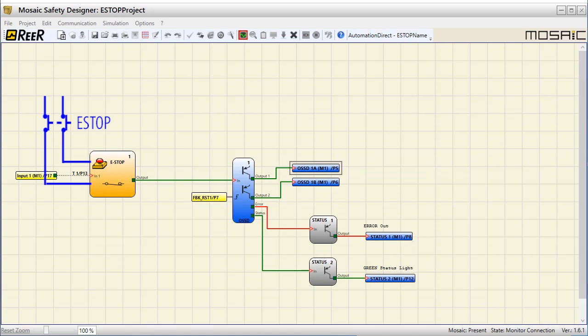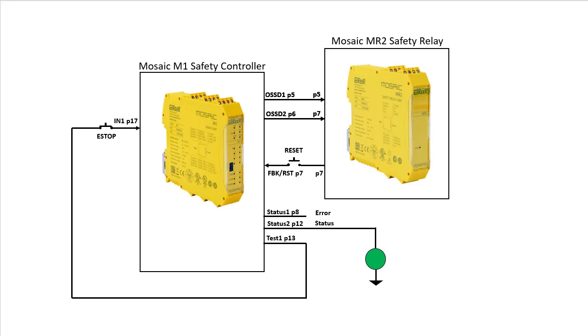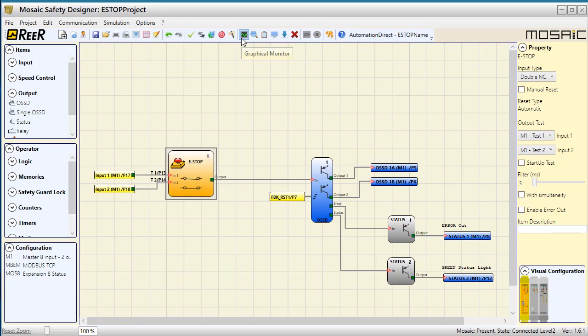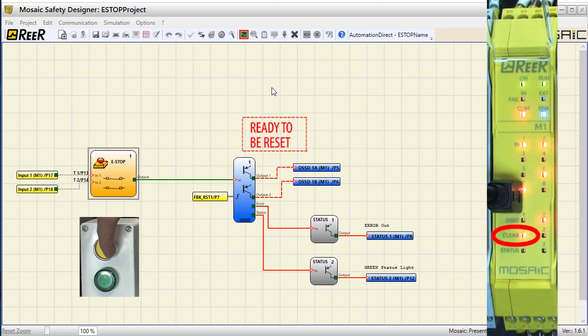Can we use a 2-contact e-stop to get redundancy? Sure. Stop monitoring, click on the e-stop and instead of a single, we want a double. Let's assign it a pin on the controller and add monitoring from test output 2 which is on pin 14. I've modified the test set wiring to match that. Verify, connect using the default password, send the program to the controller. Looks good. Let's drop into monitor mode to disconnect and restart the controller. No password is required for monitor mode. The controller is waiting to be reset so I'll do that and we're up and running. Press the e-stop and everything works as expected. I'll short out one of the e-stop leads to 24 volts and sure enough the controller shuts down the output. Release the short, hit the manual reset and we're back up and running.